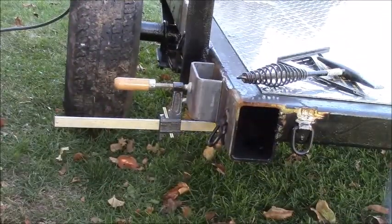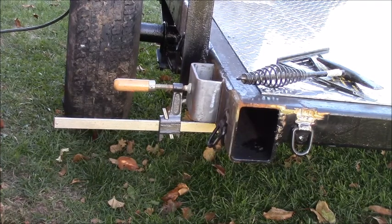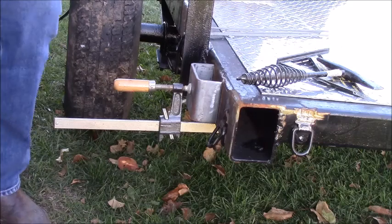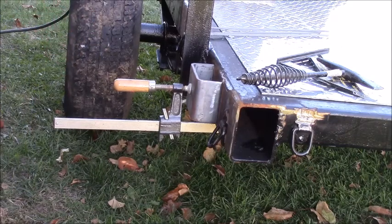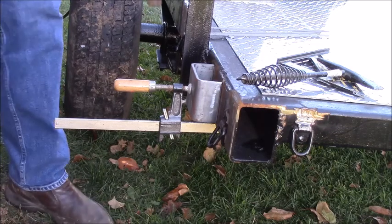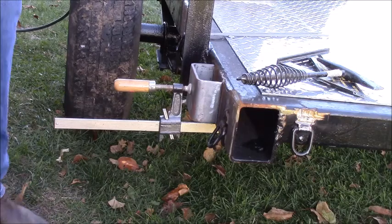All right, I'll be back. All right, we're set up here. I'm going to try to get that guy with 75 amps. Rod, 3/32 at 75 amps. And I saw a guy do it and you zigzag like switch. Gloves. Get my favorite helmet on. Alright. I'm going to tilt that rod a little bit, but he said don't.